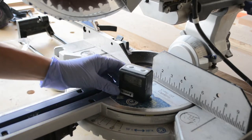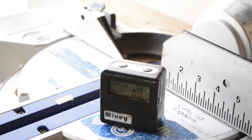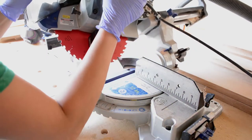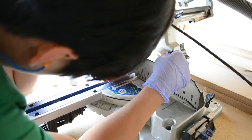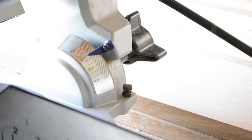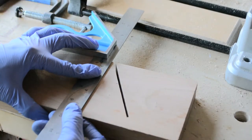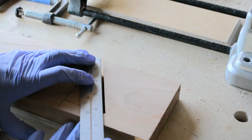I have a couple of ideas for how I'm going to get my miter saw at a perfect 60 degree angle — or 30 degrees depending on how you look at it. I put a magnetic angle gauge on the table, zero it out, and then stick it onto the blade and hope that it reads close to 90 degrees, then tilt the saw until it reads 60 degrees. I find it tricky because the number changes depending on how I stick the magnet onto the blade. My second idea is to make a wide cut on a piece of wood and draw a right triangle to see if the hypotenuse is exactly twice the length of the short side, which it should be on a 30-60-90 degree right triangle.